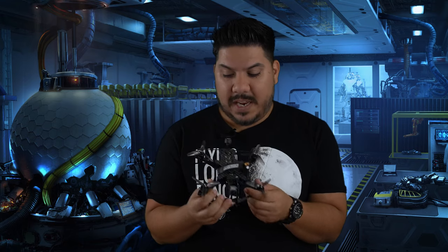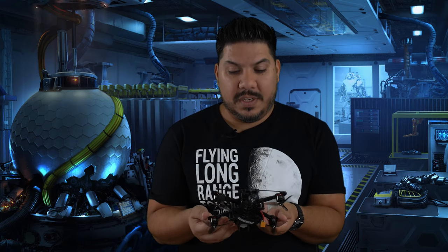I'm guessing like on a full-size Freestyle build, you're gonna be like 150 grams heavier and your battery is gonna be almost 150 grams heavier. So that's a total weight reduction of almost 300 grams. Very sizable. So great job on this Catalyst Machineworks. This is one of the first full-style frames that's fully DJI accessible, that has completely replaceable arms.